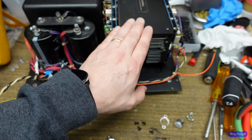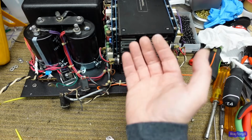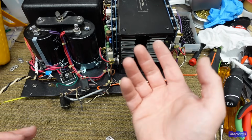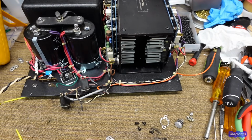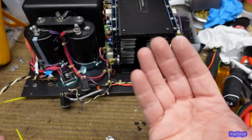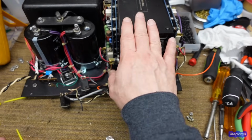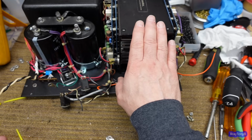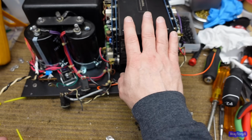Once this thing gets hot, if it gets hot, that'll give the fan a quicker response time. It'll also let it shut back down, because this fan is going to move so much air and get so loud that it'll cool it very quickly. So I don't want it to rapid cycle. The real goal here is for the fan never to have to turn on. Hopefully, if we set the bias correctly, and as long as you're not pushing this amp so loud that you won't hear the fan anyway, that fan will never kick in.